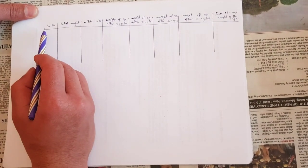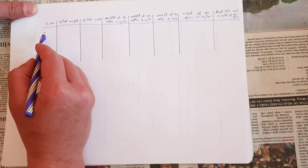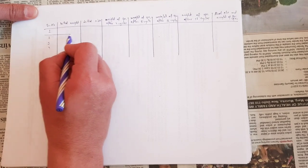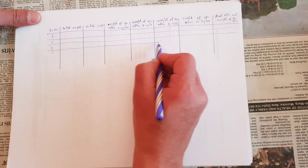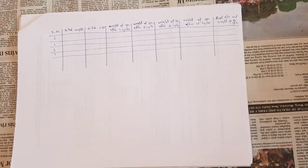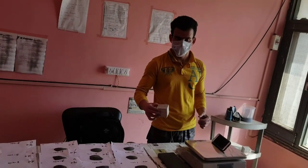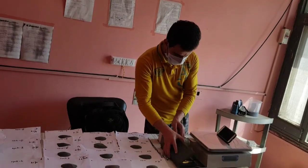Moving to our experiments, we will note down all the values in their specific places. As per IS code, we have to test four blocks, so four numbers of blocks are needed. The size and weight of these blocks has to be measured initially as well as finally. For initial size and weight, we will be requiring a weighing machine plus the vernier caliper, which you can see here.